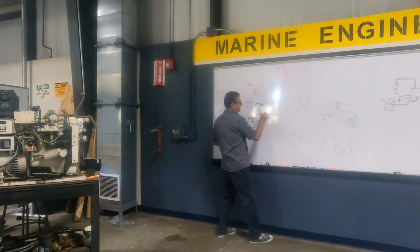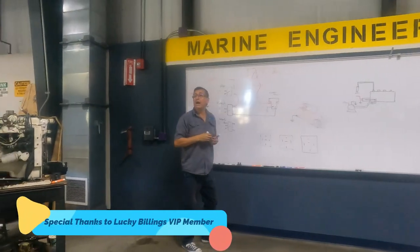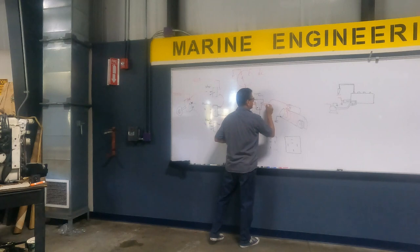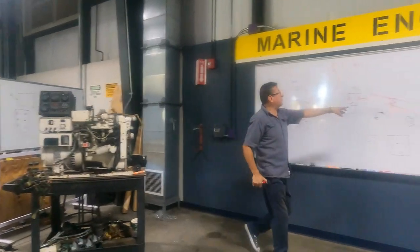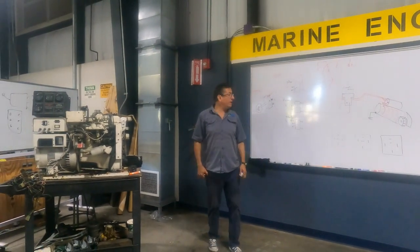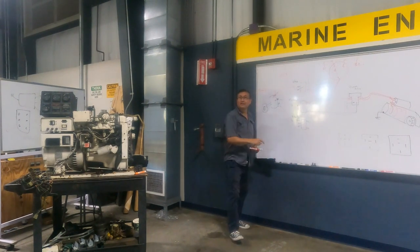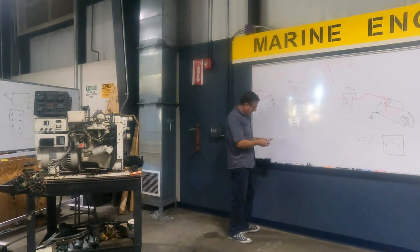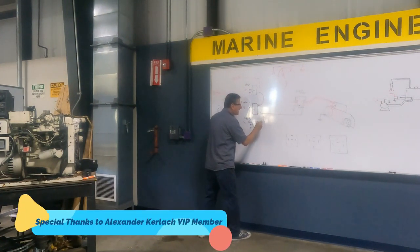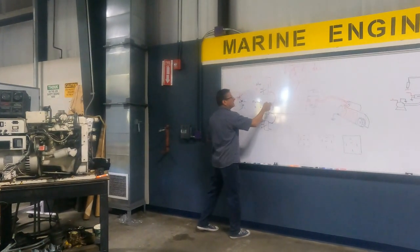And what happens when I pass the current? You activate what? The crank relay, you remember? And what happens when the crank relay closes the contact? The big current enters the starter motor. Okay, in this moment is the starter motor spinning? No. We need a signal. We need a signal coming from a start, coming from this or this. Pay attention. When I bring the signal here, when I press that button, I pass current here at the same time. This connection is permanent, exactly like this.